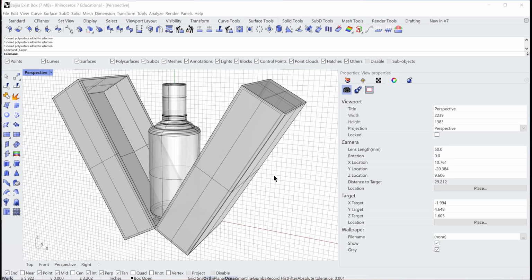In rigid boxes, since these are essentially handmade, assembled components, we're not going to delineate a die line and fold it up like we did with the corrugated and the folding carton project. This will be an assembled shape, so we need to document the design as an assembly, much like you would document a bottle or a finished product of some kind. So this is the object.